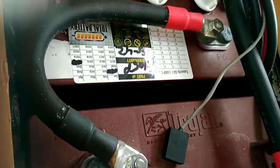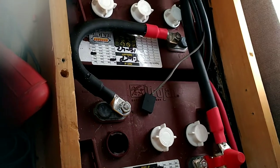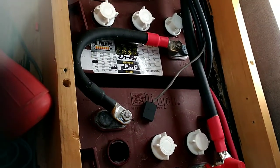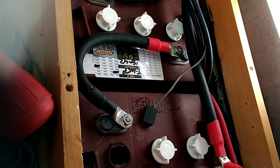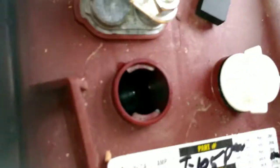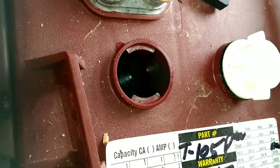I need to fill up all the batteries to that level and get the covers back on. I do this twice a year and I've used half a gallon of water in three years. As long as you keep the water above the plates it shouldn't have any problems. Obviously you don't want to kill your batteries by overcharging. It looks like these batteries would be good for the foreseeable future.